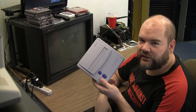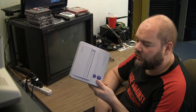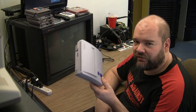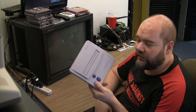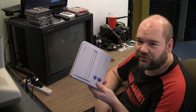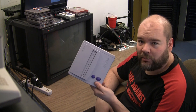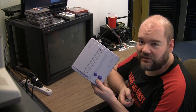I've done a bunch of videos on the SNES Junior, or the SNES Mini, SNES 2 — LEDs, S-Video Restore, stuff like that — but I've never done an RGB Restore mod on this. I looked it up and there's several ways to do it, but it seems to be fairly easy: a three-wire, three-cap, three-resistor mod. So I'm going to dig in and just prove that it does work like that and it's easy and cheap to do.